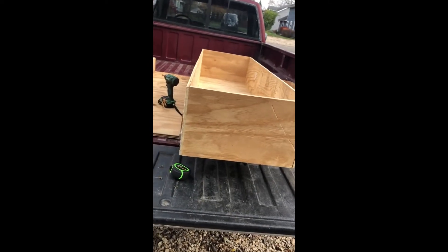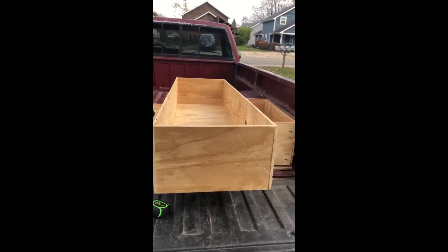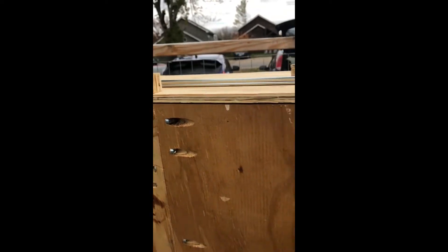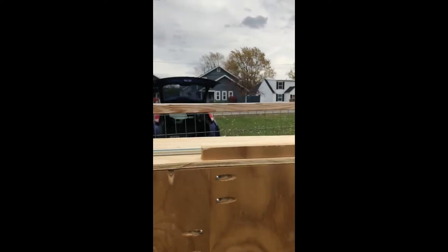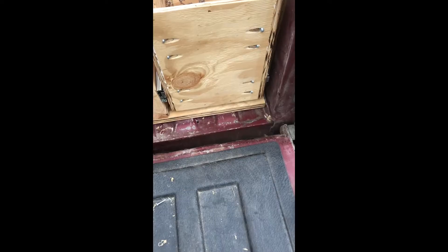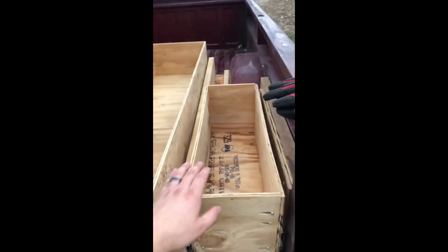I have to cut a half inch off the whole box, so I'm gonna have to take the sides off, trim off a half inch, and I'm pretty sure I've got to do it to this side too. Well, this long process just got longer. These are the pieces I had to trim off to get it to fit right. I took the side off, pulled out the nails and screws, trimmed it on the table saw, put the glue on, and I'm gonna staple it down and see if she fits again.